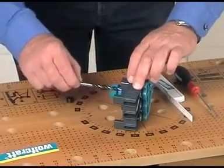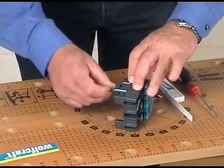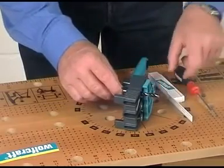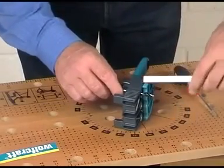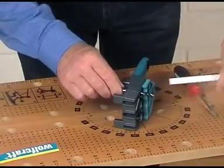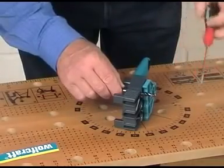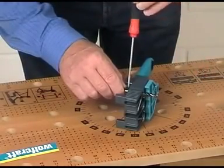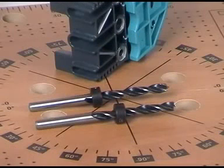These drilling depths can be adjusted exactly with the depth stop. Put the drill in the 8 mm drill bushing and put the depth stop on the drill. Adjust the desired projecting length and afterwards locate the depth stop in position. As we need two different drilling depths, a second drill with depth stop is a good and quick help.